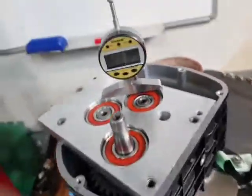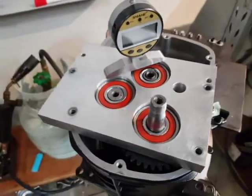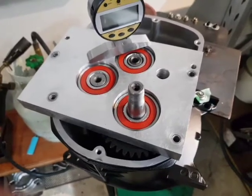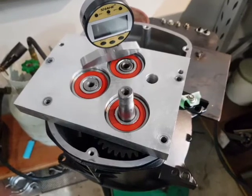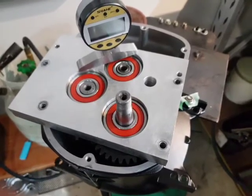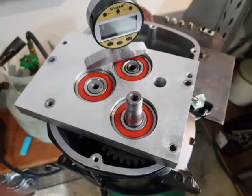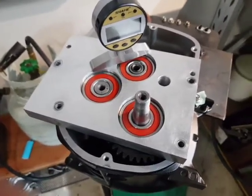This here is a plate — it's a Cycleworks made plate, I bought it years ago. These are as good as you buy, they are great people to deal with, they make some very good tools and I recommend them highly. This plate is nominally 750 thou thick. I've had people tell me their plates are out here and there and everywhere else — I haven't found that.